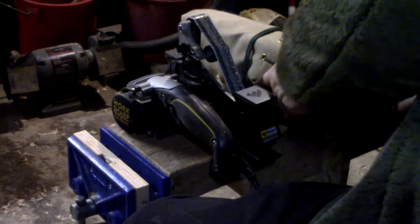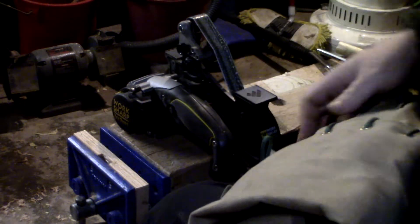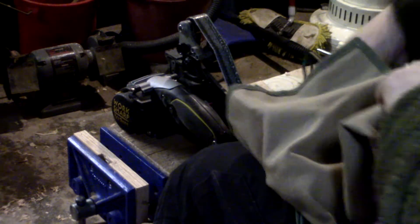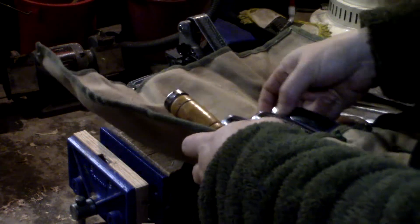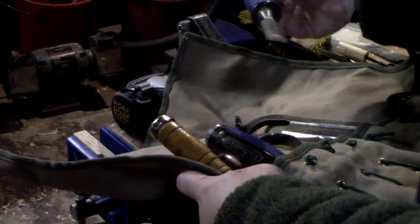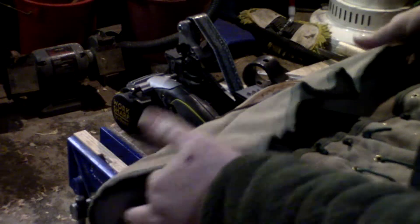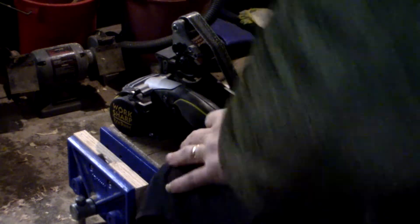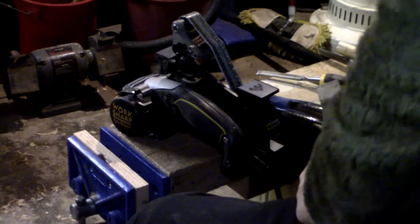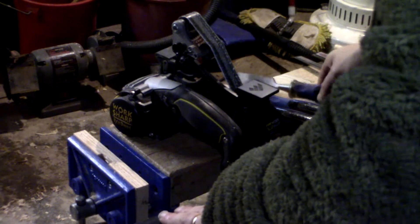As we're making our bench, I told you to check out Paul Sellers' videos for sharpening your chisels because he does them all by hand. But many of us that do fine woodworking, green woodworking, and even wood carving tend to use power machines to sharpen our chisels — or more so, honing the shape of our edge. What a lot of people don't realize is that in different styles of woodworking, having a camber on your cutting edge is much more effective than having a very flat grind.